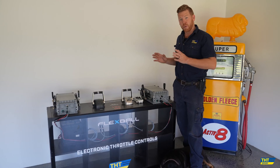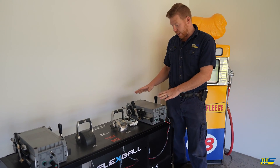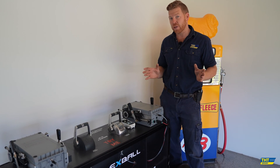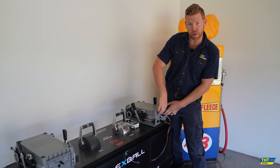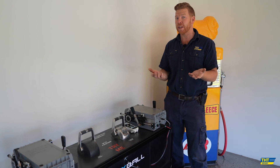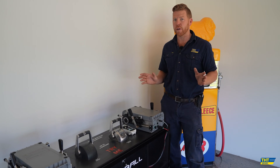So we have three main components. We have the actuator box here, which in this instance controls a mechanical throttle to an engine and a mechanical control to a gearbox. If you have an electronic system, these wouldn't be used and instead we'd have additional plugs on the front end of the actuator box. We can do mechanical engine, electronic gearbox, vice versa, all electronic or all mechanical to suit all makes and models of engines — a very flexible system.